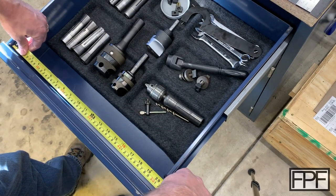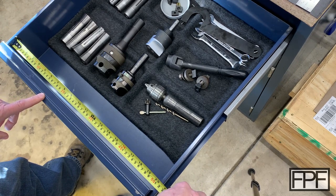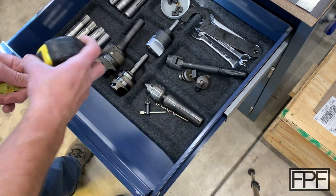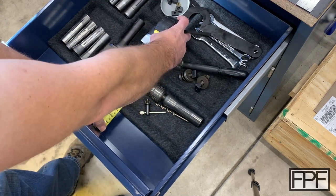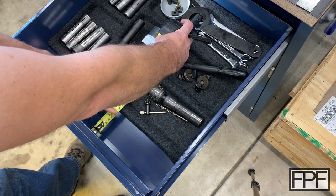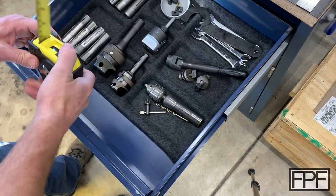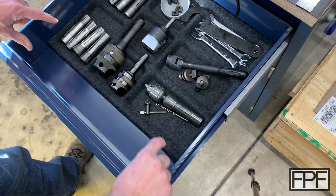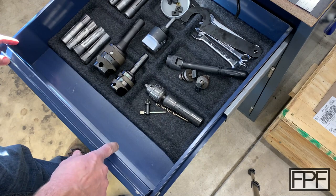So this is an inside measurement, we want to push against it. I'm seeing about 513, between 513 and 514 millimeters in width. And then in the other direction, this is a fabric flexible piece so we'll call it 70 millimeters — it doesn't need to be exact. The other thing I'm thinking is this is going to be real long but the base isn't going to be very wide, so I'm kind of concerned about it toppling over, especially with the drawer jerking back and forth just opening and closing it.